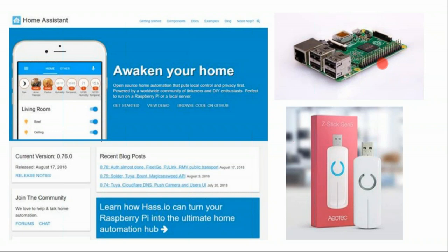Right now I'm doing energy controls on my house, and I'm running it off a $40 computer. This is a Raspberry Pi. It has an Ethernet output and Wi-Fi built into it. It doesn't have that radio frequency that I need to wirelessly communicate with my thermostat. And so I buy this. This looks like a USB drive. It's actually a USB antenna that gives the Raspberry Pi this communication frequency, or this Z-Wave frequency.